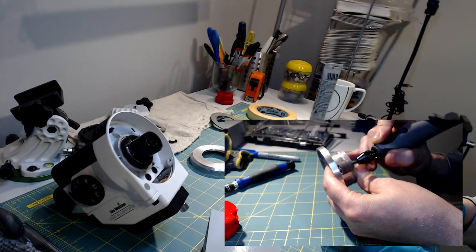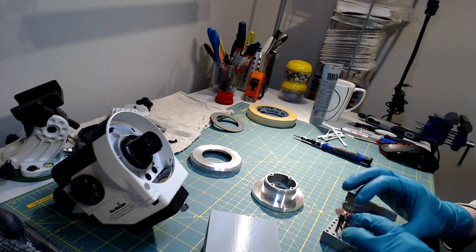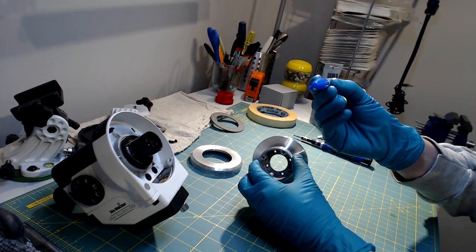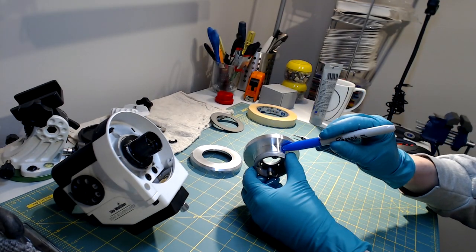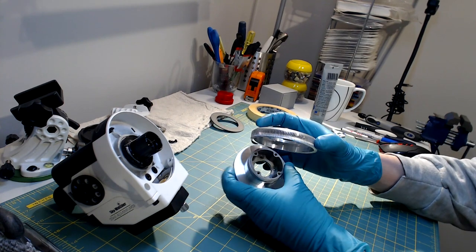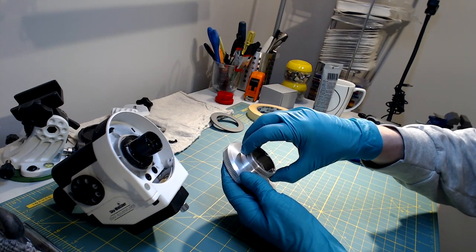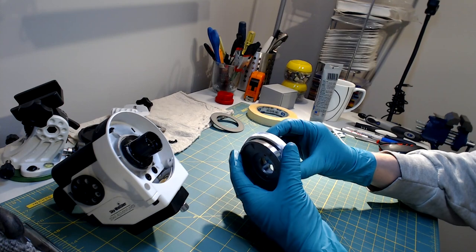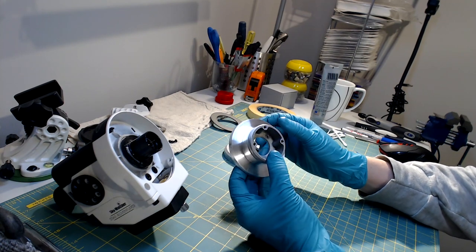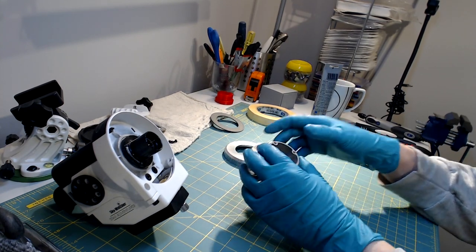And when it came to actually finding my high point, I did show you the whole toothpick method of measuring it out. But another method that worked pretty good is I would take a Sharpie marker, draw a line along the edge here, and draw a line along the inner edge as well, on the inner part of the hub. I put it together, adjust my backlash, and rotate this within the disc and get it to rub against the outer edge, and it would rub off the marker to show you where the high spot was. So I worked the high spot out the best I could. It looks all right. And yeah, so let's assemble this and see how bad it works.